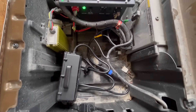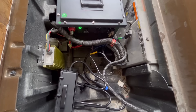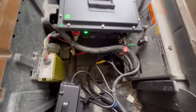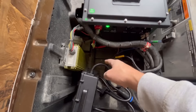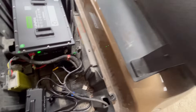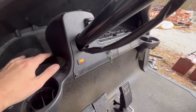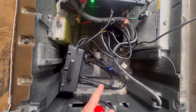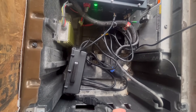I just dropped the charger in here — plenty of room for it. At 20 amps it shouldn't take too long to charge it up enough to use it up and down the driveway to test it. As far as the screen, I would plug it in right here and route it down through the bottom and then up to the front of the golf cart. You could put it on the left or over in the center — there's plenty of space. This charger is waterproof, so he'll probably end up just mounting it right in here, screwing it to the side.